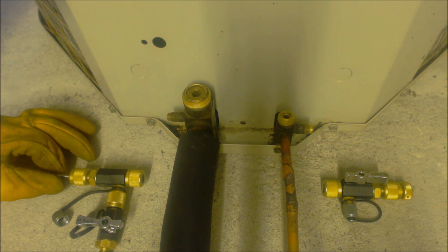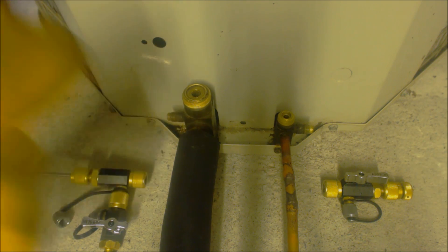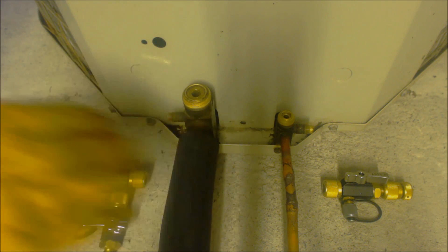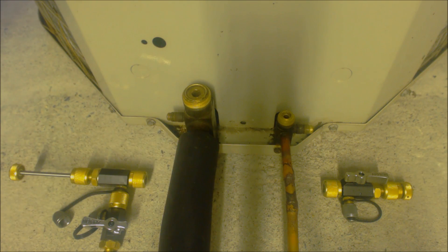We just take this off right here — I'm just doing it this way so you can see it. And that's that. So now you're ready to hook your manifold gauge set in, then turn the unit on and go ahead and check the refrigerant charge in subcooling if you have a TXV, or superheat if you have a piston. I added the tools used in this video down in the description below if you're looking for them. And if you want to support the HVAC channel and the making of these HVAC training videos, check out the Patreon page where you can also find additional training — that's located in the description below. Hope you enjoyed yourself, we'll see you next time at AC Service Tech channel.